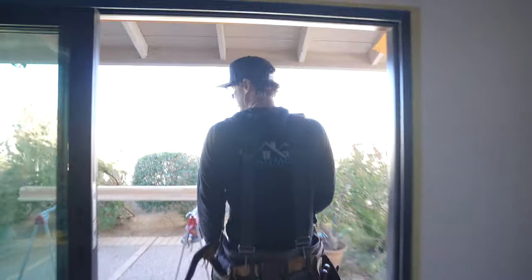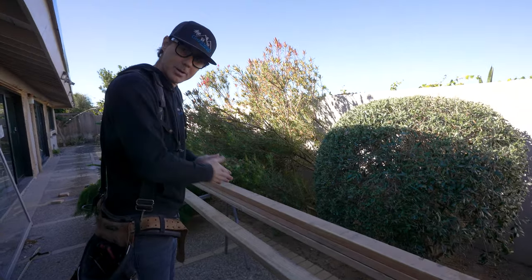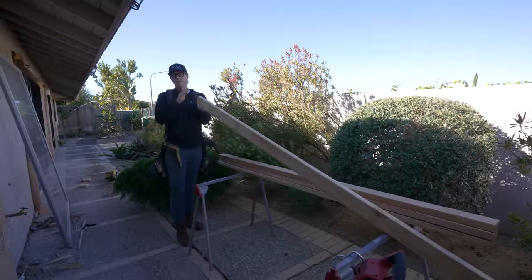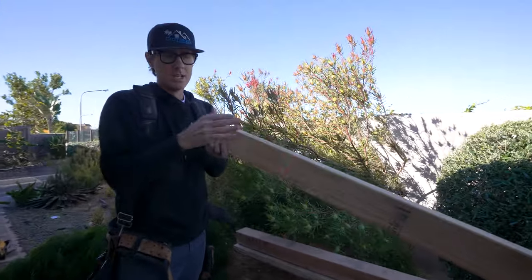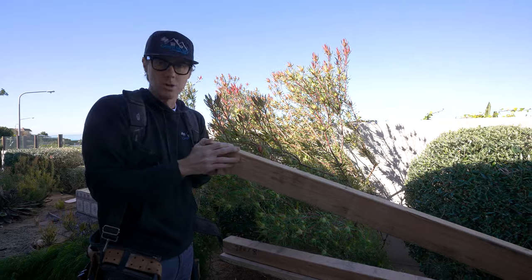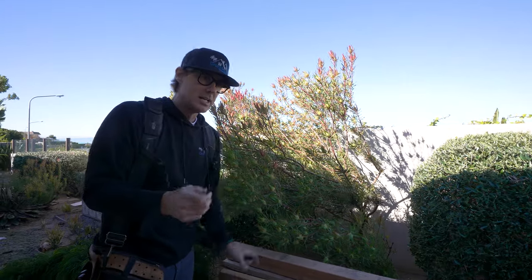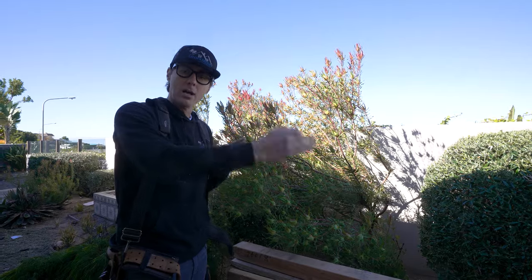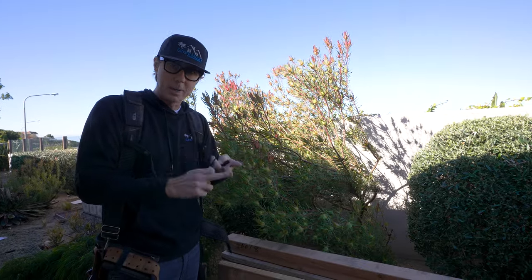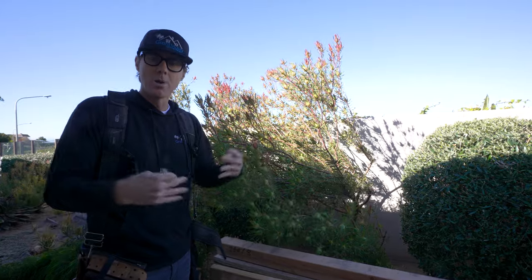I'm starting to load my cut station. The material today is Doug Fir — these are three and a half by inch and a half eight-footers that we'll cut down to the desired length. One important thing about natural wood: it has a crown, meaning a natural curvature. It's really important to sight down the edge of your framing material and identify which direction the crown is going. I mark it so the crown is up, to make sure all boards go in the same direction. If you stagger the crown, you'll have problems with finishing your drywall.